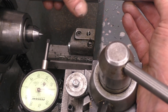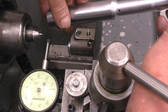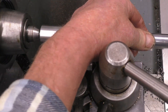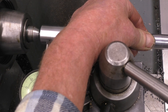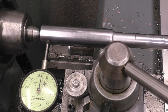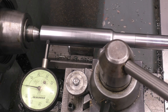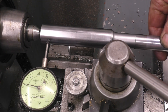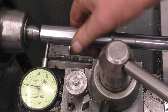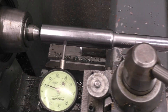I've got a piece of ground bar here with really accurate centres on both ends, and I'm going to use this as a test piece. We'll put it into that centre and then bring the tailstock centre in — just a little nip on it. Touch the dial gauge onto it and set to zero. Now if I revolve that and it doesn't move from dead zero, because that centre was turned in this lathe, there's nothing else but in line. So we'll put it into the tailstock end.